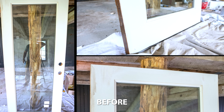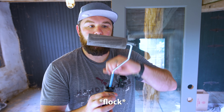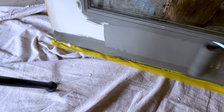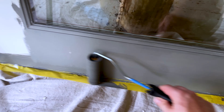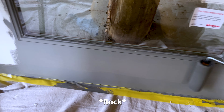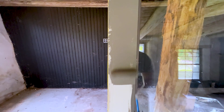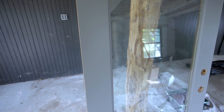This door is all done on my end. It's going to get installed in a couple days. I finished the door frame and everything turned out pretty well. One key takeaway is that I really liked this flock roller cover — it's probably one of the first or second times I've used one and they work really well to lay down a spray-like finish on anything you're rolling. One issue you can run into with foam rollers is they leave bubbles in the paint, but the flock's little hairs on the outside pop those bubbles. It's quite a pleasant-looking finish. So if you're rolling flat panel doors and want to up your finish quality, check those out — definitely worth a looky-loo.